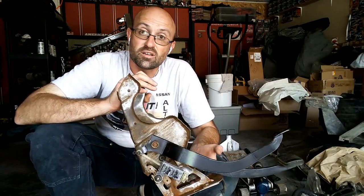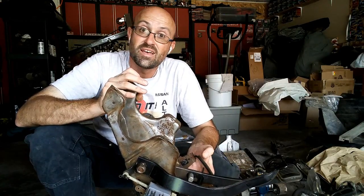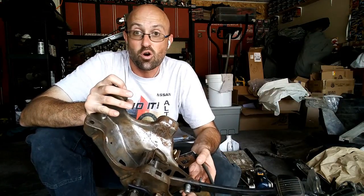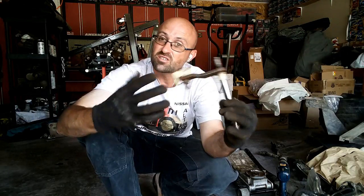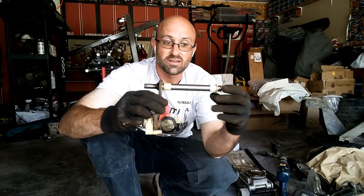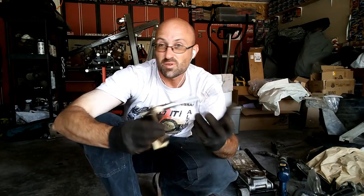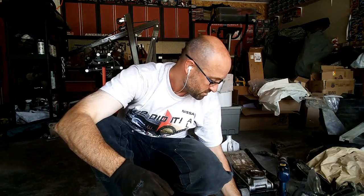To start taking this apart, all you have to do is use a couple of adjustable wrenches — everything is mostly screws — and then you can get a pair of needle nose pliers or channel locks for the R-clips that hold on a couple pieces. As you start taking this apart piece by piece, just remember to keep everything organized. You're going to have plastic bushings, like here on the clutch rod itself; keep those aside.